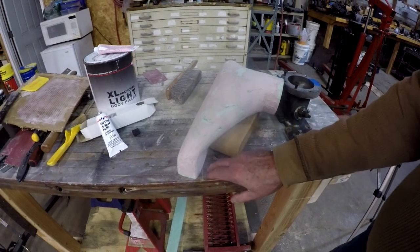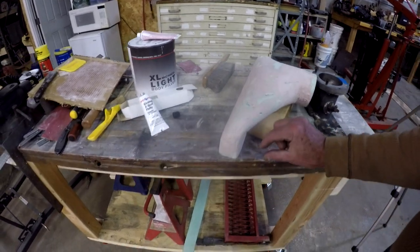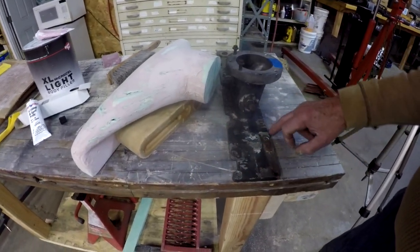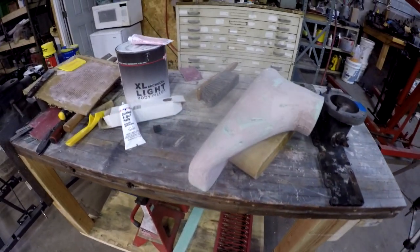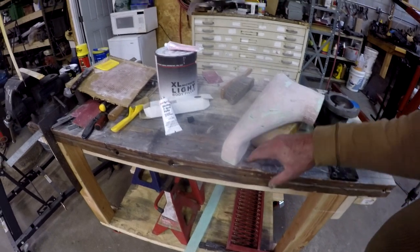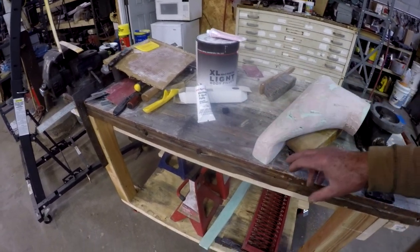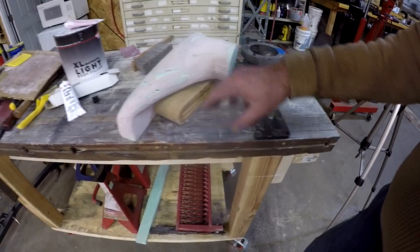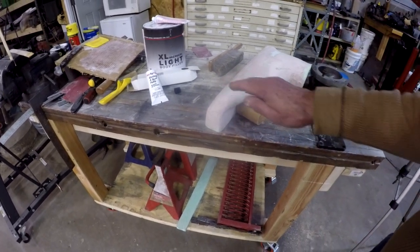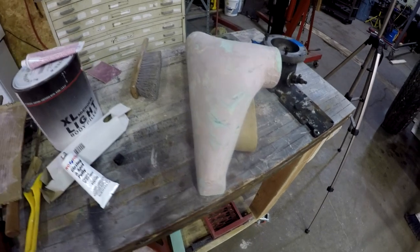Like I talked about in other videos, I'm going to use Lexan to provide the base and that ring that goes around it in the shape of the outside, so I can make the flange that attaches to the bottom. It's not going to be attached in a separate process — it's all going to be part of the carbon fiber build of the whole thing. The carbon fiber will go down into that flange, and the flange will be multi-layers of carbon fiber, with the layers that wrap around the mold going down into the flange area to provide strength between the flange and the main part of the intake body itself.